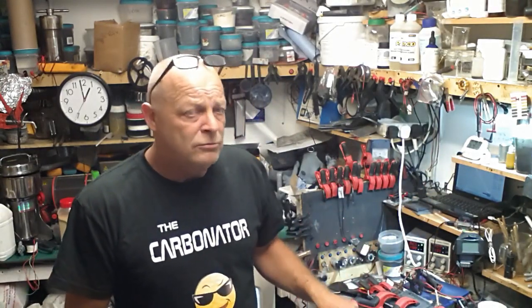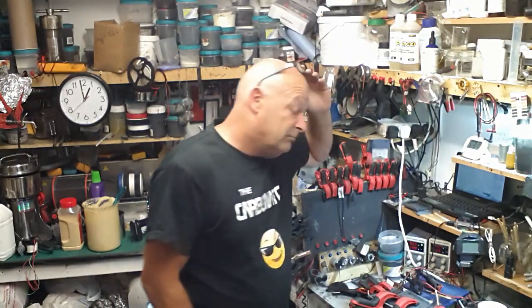One of the guys I would trust is RMS, and he said in reality it's nowhere near that. So I tend to trust that comment. The reality of all of these batteries that you see from these manufacturers isn't the real reality in the real world. But in this real world today, now, it hasn't changed yet, but 130 milliwatt hours, that's what I've got on my data logger on my third charge, discharging at 70 milliamps constant current.